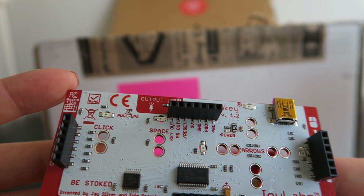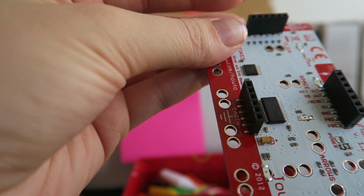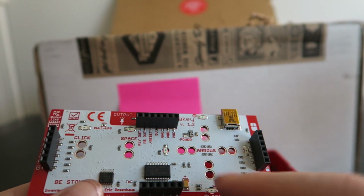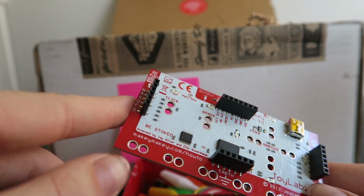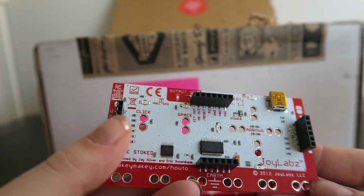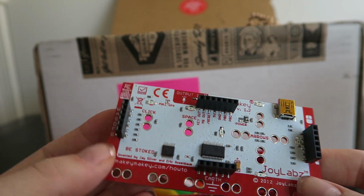So here you can see we have key outs, a reset, 5 volt, a ground, a PBD and PGC? Yeah, PGD, PGC. Hard to look through this and also read the inputs there. So we have arrows, the power. These are also the directions, a little right and left click here as well. I guess the backside is if you're interested in going a little bit more in depth than just hooking up and going. But yeah, we also have a WASDFG, I guess for, you know, if you want to do directional keys that way as well. And of course the little USB input. Very fun! I can't wait! Oh, and an LED output.